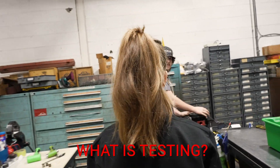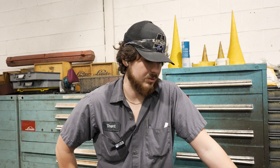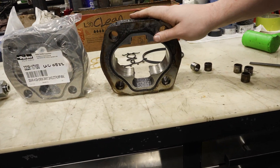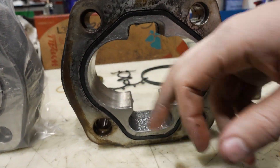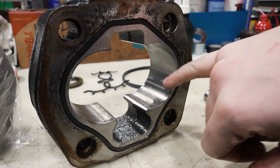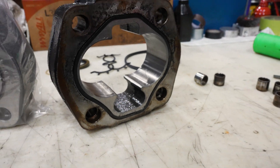Trent, what is testing? It is to ensure that the pump or motor works to its proper function. For a gear pump, you'll just spin it in - basically break in the housing. You're never going to have a perfectly machined finish. You can see those scores - that's wear. A brand new startup on the pressure side would probably look a little more like that. So the test could be to break in a pump - a bunch of stuff you could do on the test bench.